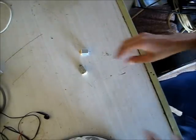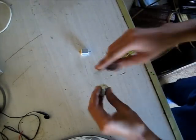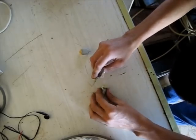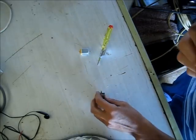Alright, viewers, I'm going to try and do one of these little overhead bench tests for you. I have to work on the top inner adjustment. I have to get this camera exactly spot on, but let's get this thing undone. Pull open the little tabs on the side. They can only be bent a certain number of times and then they start to snap off. You can see the brushes there, if the camera can focus on that. Yeah, tips are burnt out. Just got to get those tips touching again and it should fire up again. Try and get a good view on the camera here, you've got to get used to this.